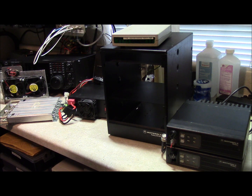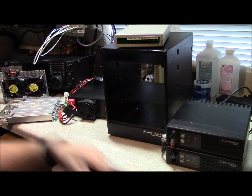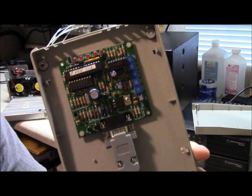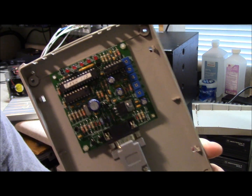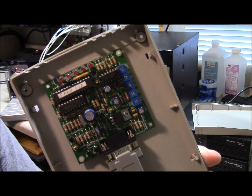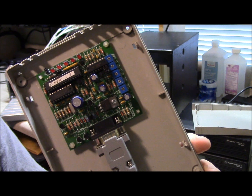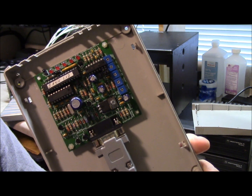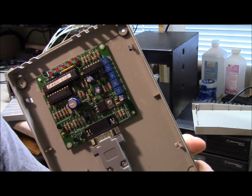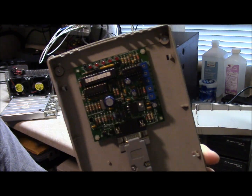Okay, here's the repeater field strip. Going over the components: we had an enclosure, controller, transmitter and receiver, a power supply, and a duplexer. This is the enclosure open, showing you the repeater controller. This repeater controller is an ICS controller and it's a fantastic controller — they're not much money. I think I paid like $75 for it, and it's a lot of bang for the buck. It does DTMF over-the-air programming, CWID, it's got a beacon mode, and many other features and functions far in excess of what I use it for. It's a nice small form factor too.